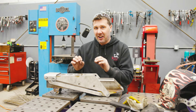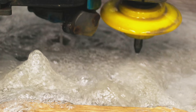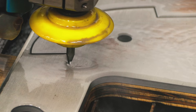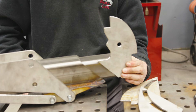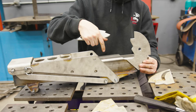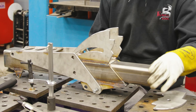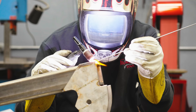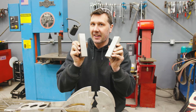This jack is turning out awesome, but I'd also like it to be a clamp. I'd like the clamp to look more like a vise, so we need to fabricate jaws that are offset from the main tube body, and incorporate some way to hold something round like a driveshaft. I'd like the jaws to be strong enough to maybe pull a bead off a wheel. When I switch the jack to a high-lift configuration the jaws will be a really important component. We have our lifting arm, our vise jaws, and our sliding tube which also needs a matching set of jaws welded onto the receiver tube.